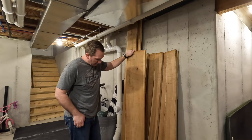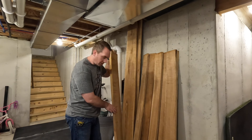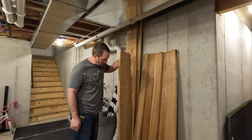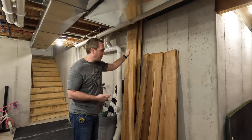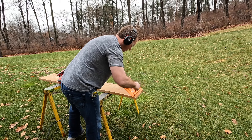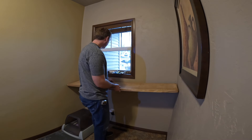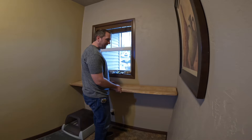So this piece will do the trick. Maybe we'll cut it to length. You can see it's definitely rough sawed — Alaskan milled. This one didn't cut so well, but this side is decent. We could plane this thing and get it into shape. That's why you cut it extra thick when you Alaskan mill it, because you're going to have some roughness that needs to be cleaned up. I cut it to length just to set it in place and see what it looks like. The length is perfect, but we might need it a little wider.